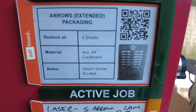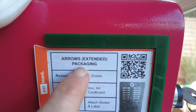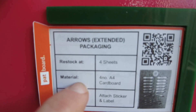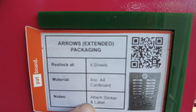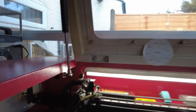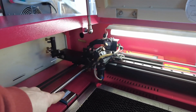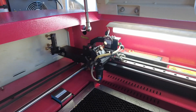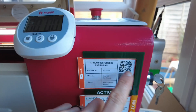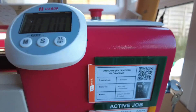So I've made some changes. This is what the new card looks like — I've got a QR code, a rough picture of the product, and much simpler instructions: just what it is, the pull level showing how many I restock, what material I need — in this instance, four sheets of cardboard — and any additions, like stickers and labels. I've also realized there was loads of excess motion picking up the gauge block, so I now measure the height right here, which makes a lot more sense. The QR code actually sends an instruction to the PC through a clever bit of software, and it will run the program. 46 seconds to beat.